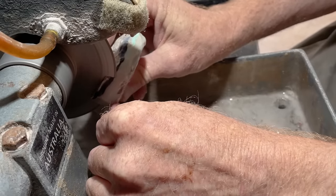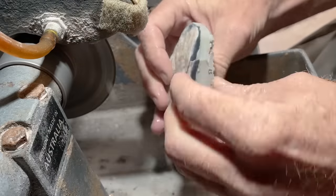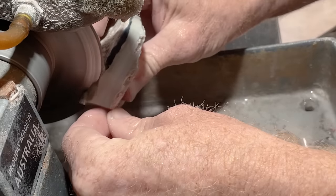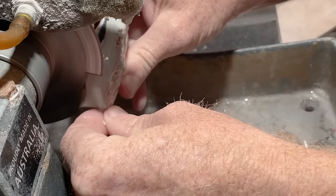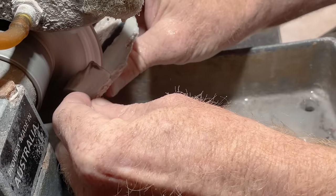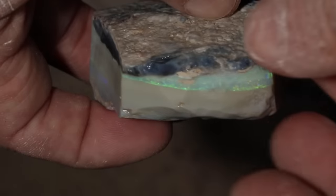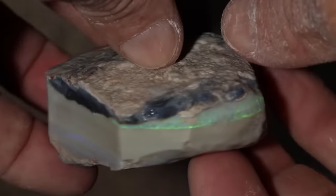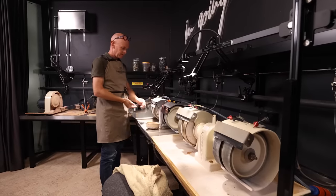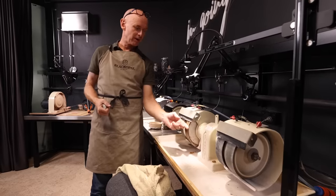You may find a few sparks as I'm slicing through here, and the reason is I'm just being too impatient — pushing too hard, which made me lose about 50% of the diamonds on this blade. You really need to take it slowly, use lots of water, and your blade will last much longer. Because there's so much rough, I'm moving over to the 90 grit wheel, which is the roughest wheel I have.